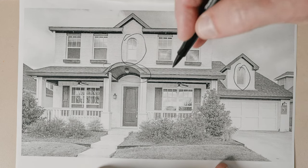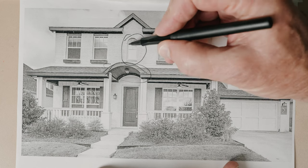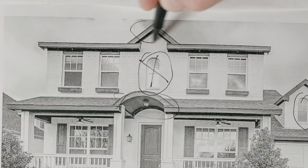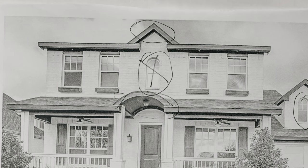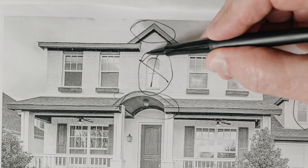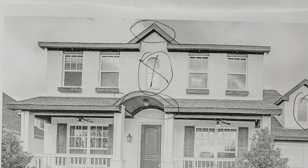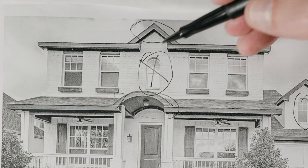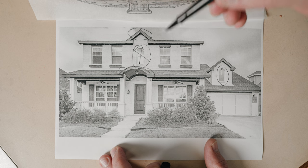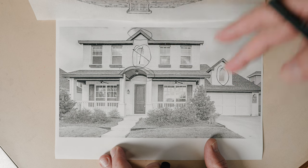I'm going to go back to that Foursquare design and fix some of these elements. If we can just get rid of this little hat - this little roof here isn't necessary. Certainly this window isn't kicking up through the roof line enough to cause the roof to actually require a pediment there. This is a builder design trick, not a good one, where they apply details to give it more visual interest.